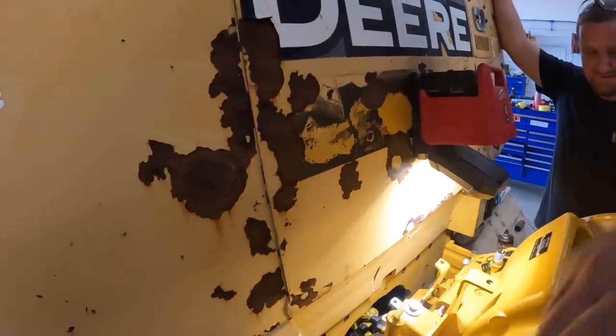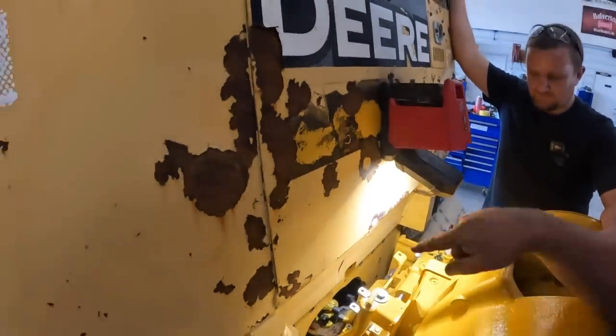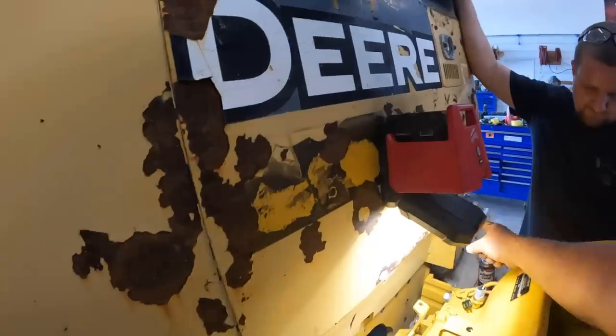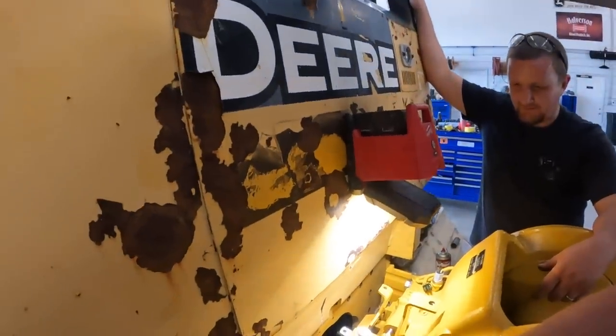Yeah. You know what I'm seeing? We screwed something up here in this video. What do we screw up? Pro tip. We're used to doing 700s, so we brought that control cable out through that hole like they are. It's actually got to come out here, because it comes through here. Right. And that vent hose.